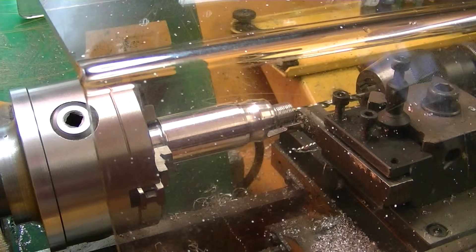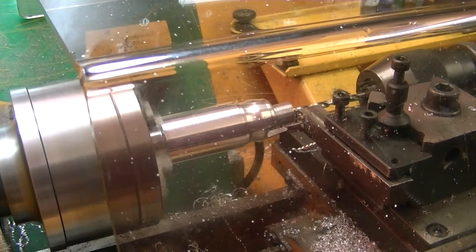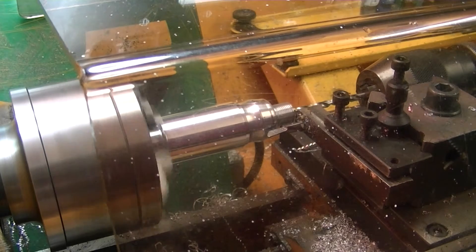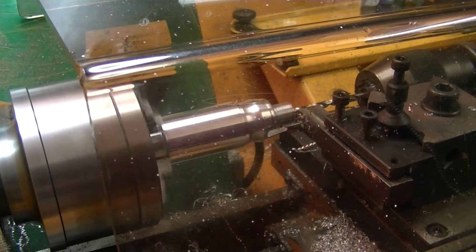The drilling is going to be done in manual mode, so I'll start the motor. The drill is set up and in a chuck. I need to now drill to 10.5mm depth.